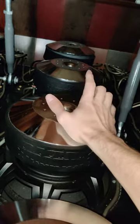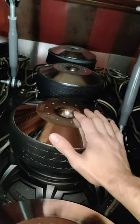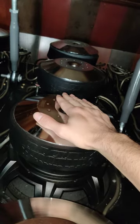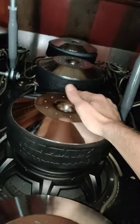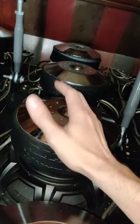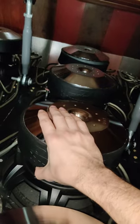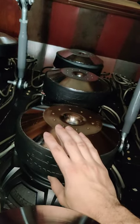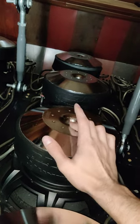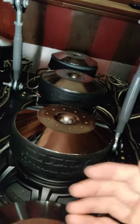That's how to wire in series and parallel. The most common way is parallel, which divides your ohms in half, while series multiplies your ohms. You can also wire series-parallel or parallel-series, but that gets more confusing — I might show that in a future video. That is how to wire in parallel and series on dual voice coil subwoofers.